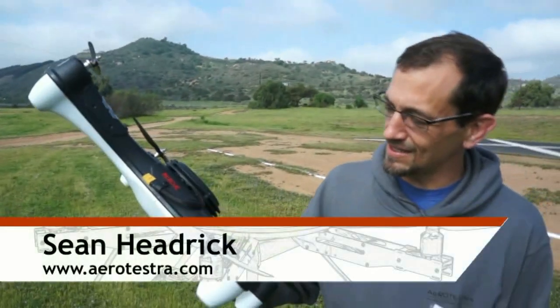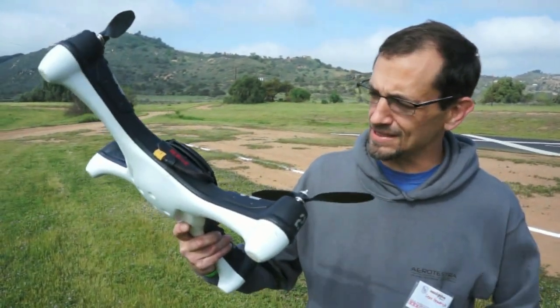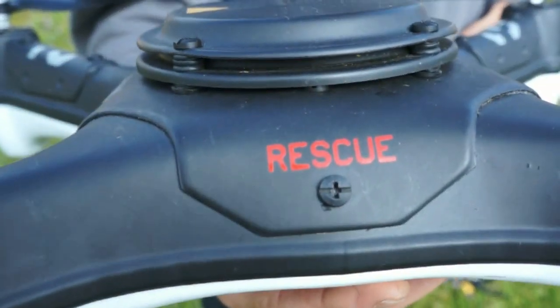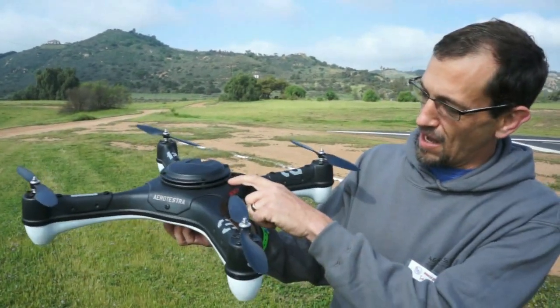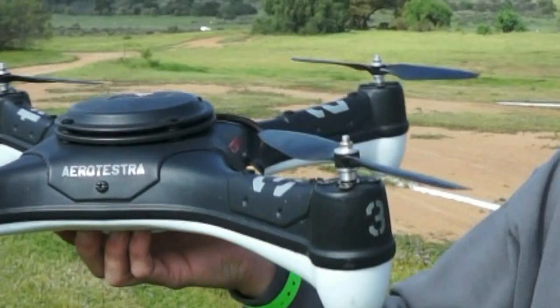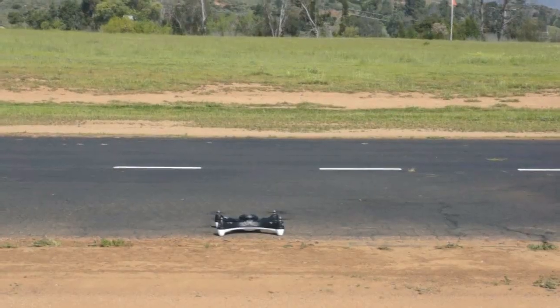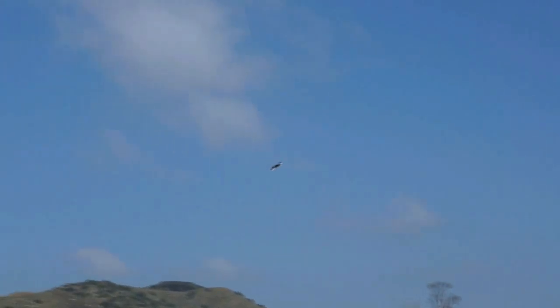This is a thin-shell monocoque airframe for multi-rotor aircraft. It's vacuum-formed polystyrene. The motors are enclosed in motor pods at the ends. It can fly in any kind of inclement weather, though it can't do water landings because I allow for venting of the air in the frame. With a 4-cell setup, 2217-size motors, 30-amp ESCs, and 1045 props, I've gotten 16 minutes of flight time — and that was hovering in probably 20 mile-per-hour wind.